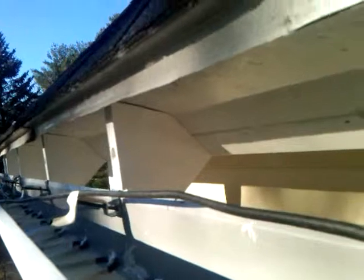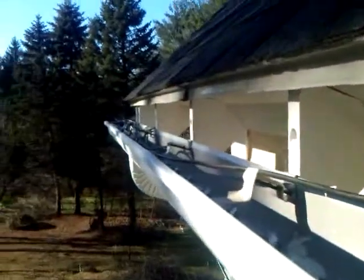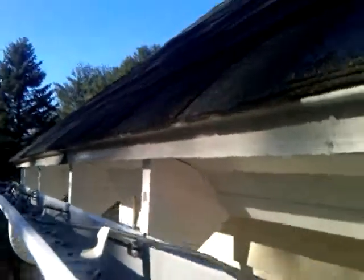I had to use little washers because the angle wasn't quite right when I cut it — you're going to have that to some degree, but it came out pretty well on the later ones with a really good measurement. This is PVC plastic so it won't rot, and I used lifetime galvanized screws up inside. The washers are all stainless so they won't rust and look nasty.